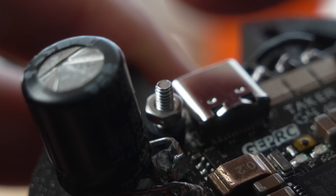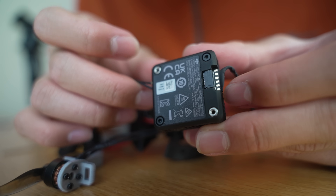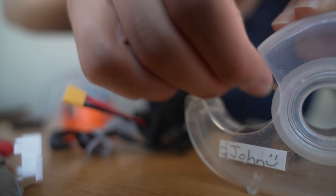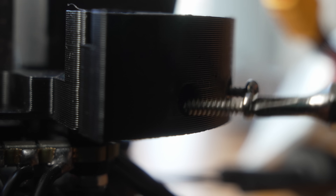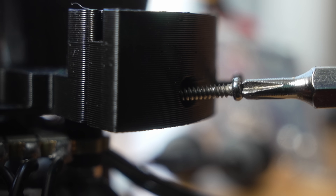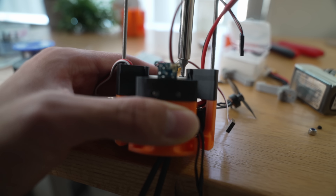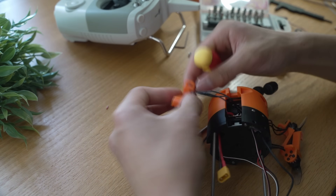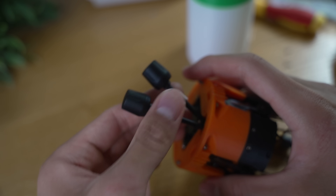Cramming all these electronics into the tiny can genuinely took so long due to many unforeseen issues — like the video transmitter not having holes on the bottom, so I had to force in tiny nuts to hold it in place. These screws are kind of funny: if you try to use force, they end up falling out or getting misaligned, but if you stay calm, you're much more likely to succeed first try — which is kind of an analogy for other things in life. Now we can attach all four arms and screw on the motors, and just like that the densely filled upper section is done — and the arms release perfectly.